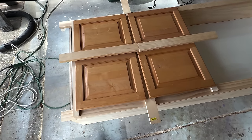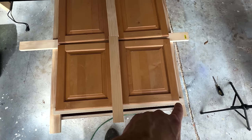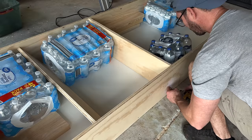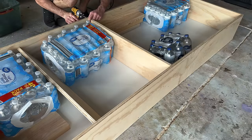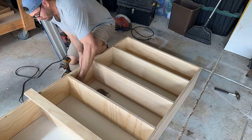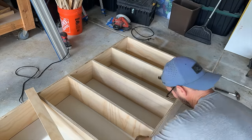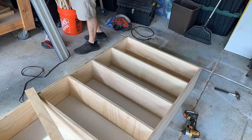I have these doors left over from another project. Just dry fitting everything to see if I can get my measurements right. A technique I recently learned was to use blocking instead of trying to measure each individual shelf - this way you get way more accurate distances between your shelving, and it's a lot easier when you go to install your face frame.